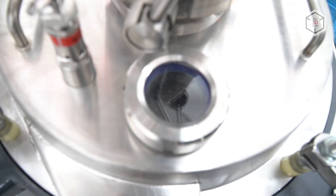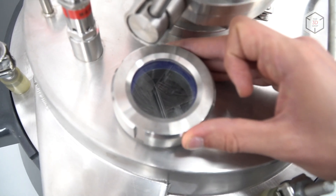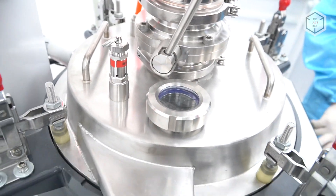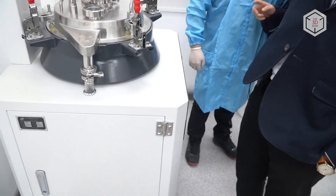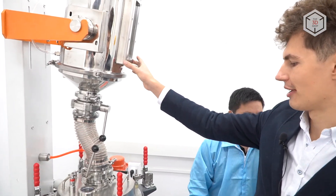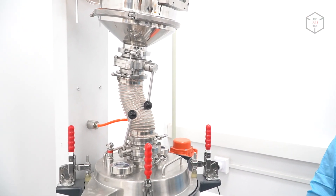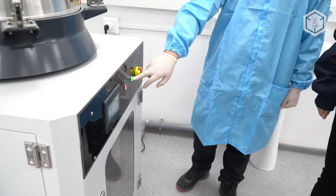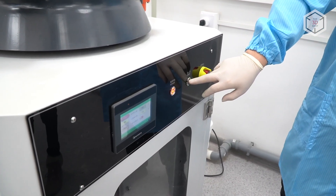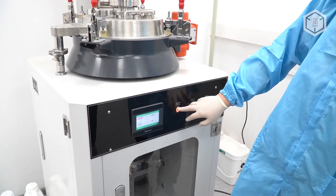In order to find out if the powder sieving process has been finished, we can use the lens installed here to see if there is any powder remaining. We also have the glass where we can see if there is any more powder at the top container. After we see that the process is complete, we can finish the sieving process by clicking the start button once again. After the sieving is complete, we can power off the machine.